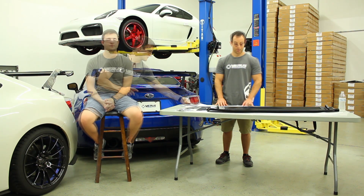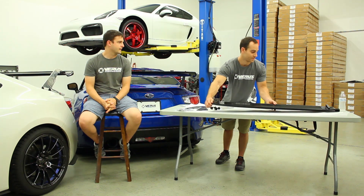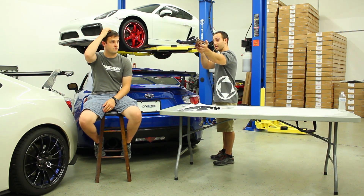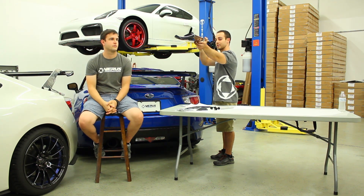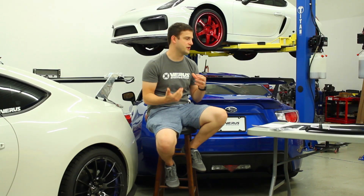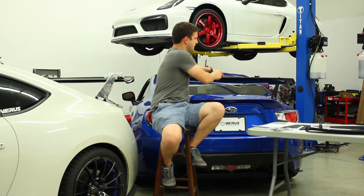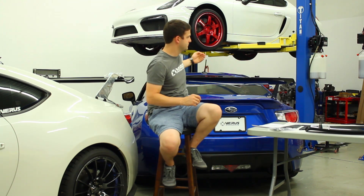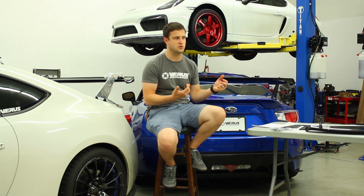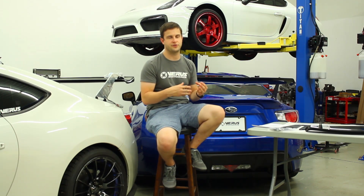Something else we've heard is why does the airfoil look so odd — almost like a U shape — and it is very different from most other airfoil profiles. The reason the airfoil is shaped that way is firstly because it's a 3D profile, meaning it has a profile in the XY direction and it changes as it goes down the span. We specifically designed it to have the exact shape we wanted in order to control how it stalls.